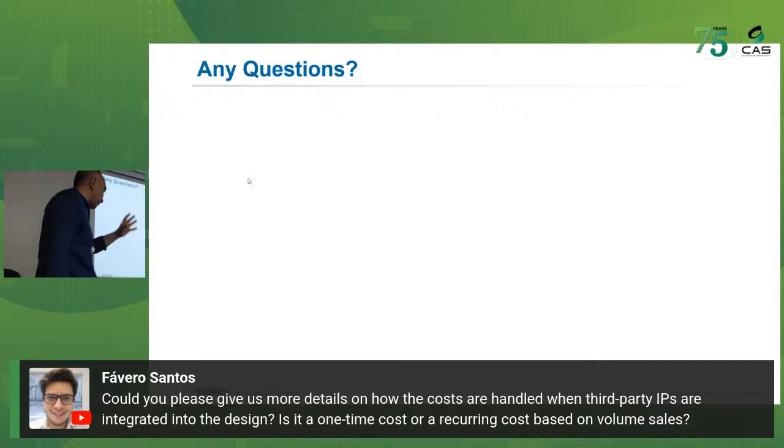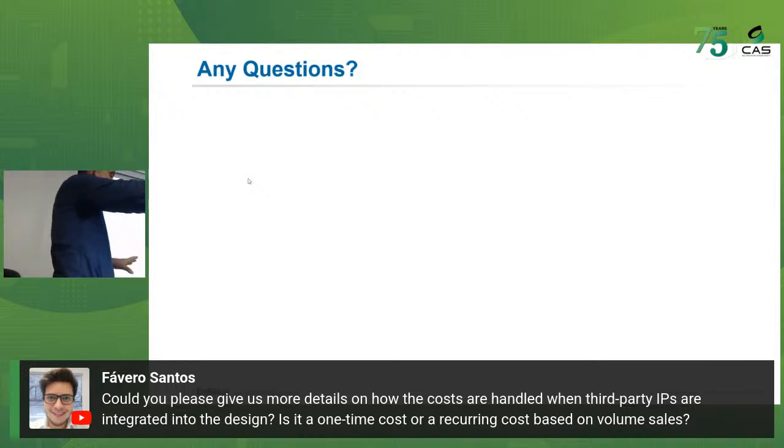Just to say a few words on that. We very often incorporate FPGA as part of our verification sign-off, because silicon is not forgiving, bugs are very expensive, respin masks and so on. We have two implementation paths. One is the main ASIC implementation path, and the other one has the objective to create an FPGA, if it's possible. It depends on the size. Sometimes it's not even possible. Sometimes you have to accept that a subset of your system goes into an FPGA. And you use that FPGA to run more extensive verification tests to minimize the probability of a mistake.